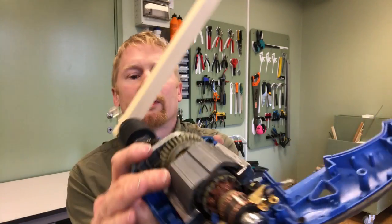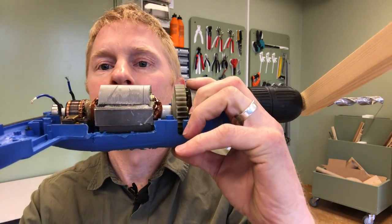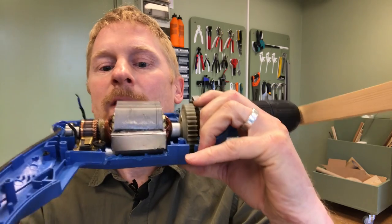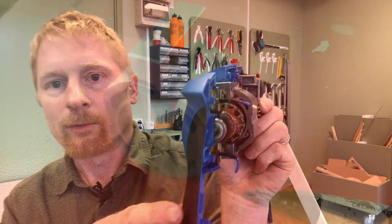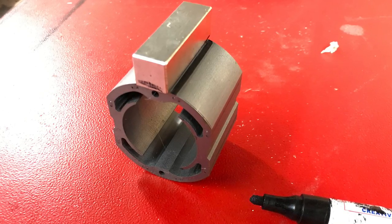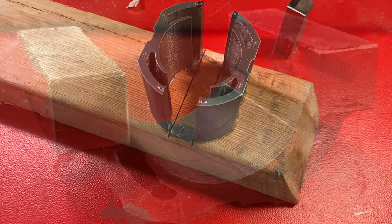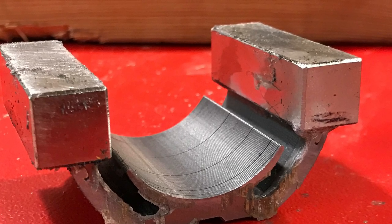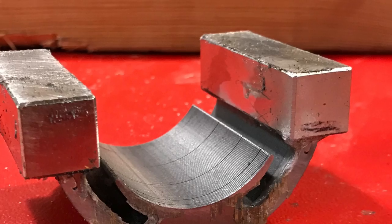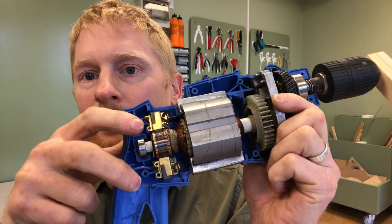Today's test was to find that out, and it turns out to be a fairly simple modification. You can see the permanent magnets inside — I simply cut the stator in half and replaced the 15 millimeters of metal I took away with permanent magnets, so we have a north pole side and a south pole on the other side. I marked out where to make the cut, and attached the stator to a wooden plank first so the laminations wouldn't fall apart. I glued the magnets onto the stator facing the same direction — both south poles pointing up and both north poles attaching below. I also removed the electronics and simply apply power to the brushes.